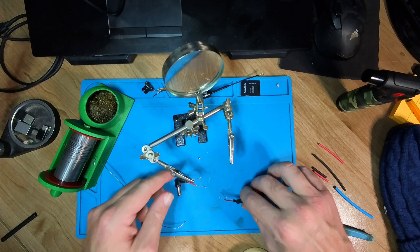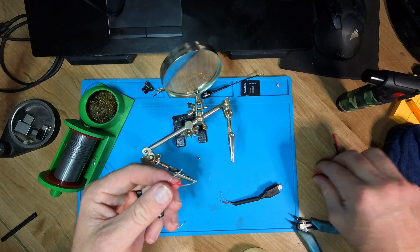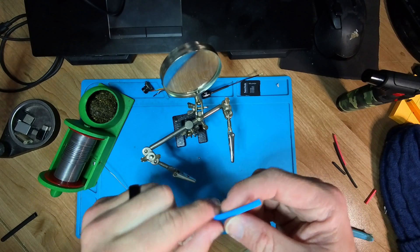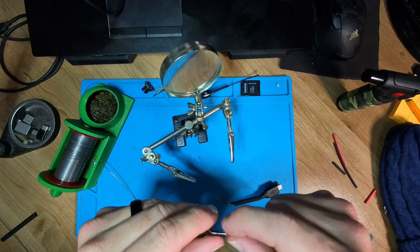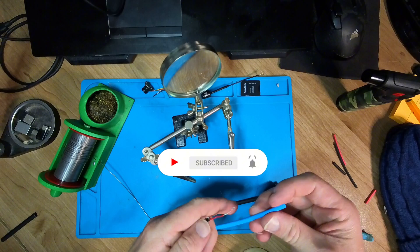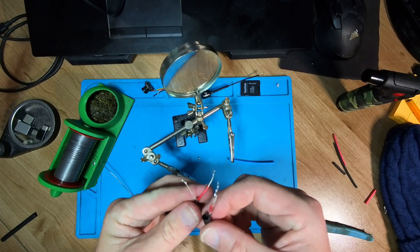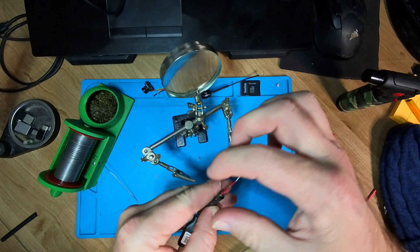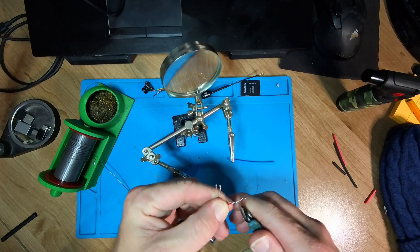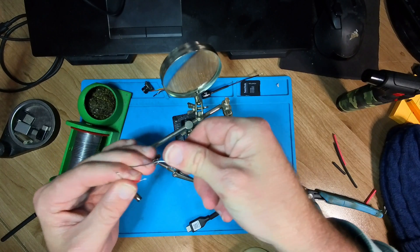I've got this bit sorted. What I want is at least one of these wires also covered in heat shrink before I go over it. I'll get a nice thick piece of blue heat shrink to sneak over the joint. I also just need to check the length of my wires — the red is significantly longer than the other one, so I'm going to trim that off and tin a little bit on this wire over here, then stick it into my flux.